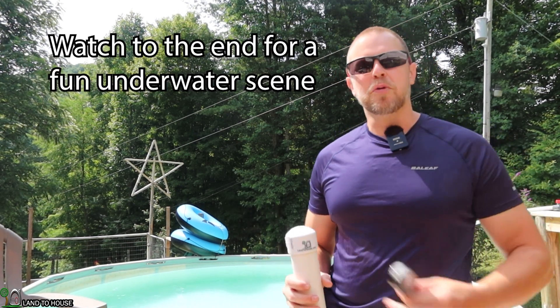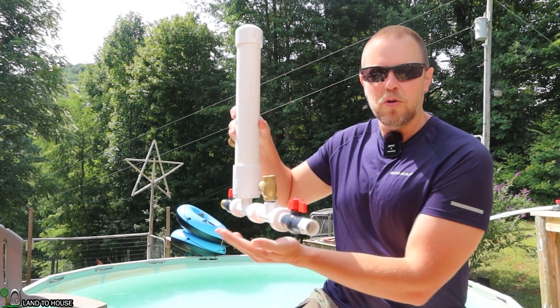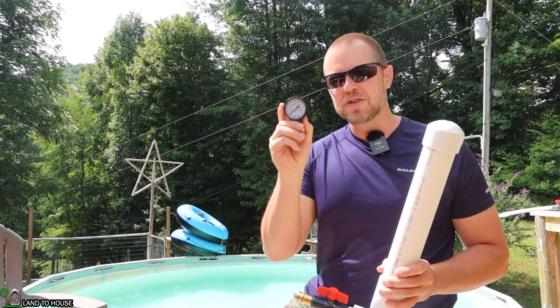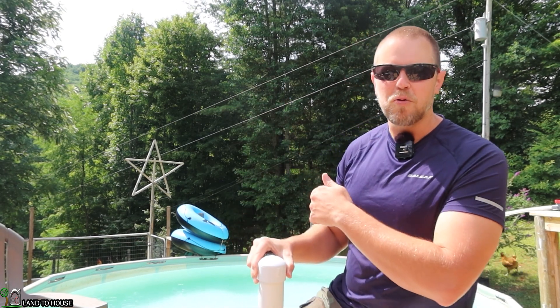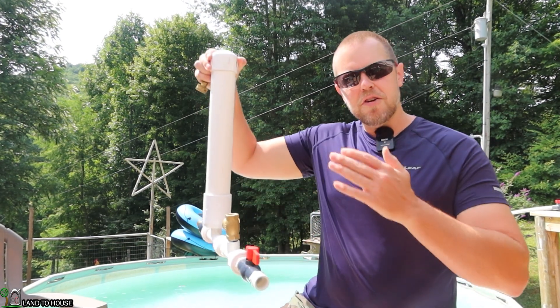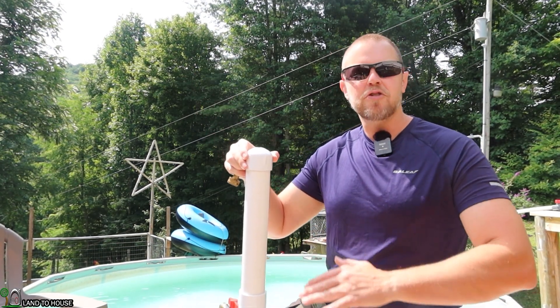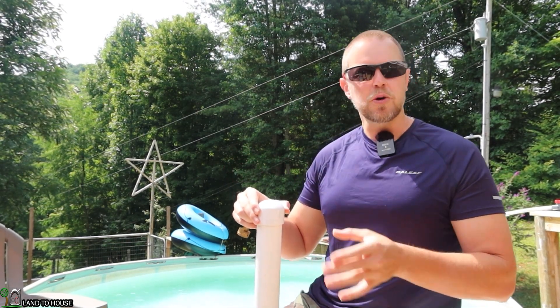I'm going to run three different experiments. The first one, I'll hook up the ram pump and hold it on top of the water, time for one minute and see what the pressure is. Then I'll sink the pump under three feet of water and do the exact same one-minute experiment. We should have the exact same pressure, because even though you're adding three feet of head pressure, you've got that hydrostatic pressure on top of the pump negating that additional head pressure — so it should be a zero net gain.